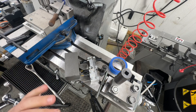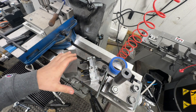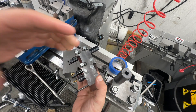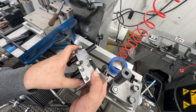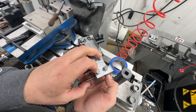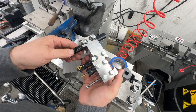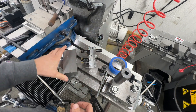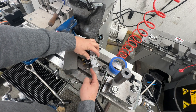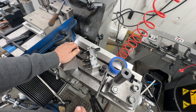All right gang tooling — I built this one right before Christmas and it worked great, but after I machined it out with carbide tooling I found out it was so hard I couldn't tap it with anything. I countersunk some nuts in there and just welded them in place, which works fine, but I wanted to build my final version of gang tooling. So I got a piece of metal that's a little bit wider for more support, and we're going to cut a dovetail in it.